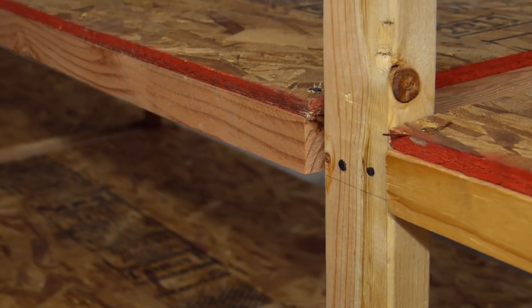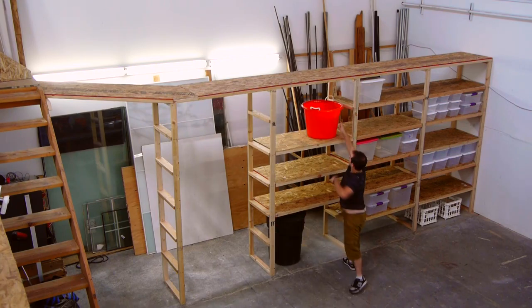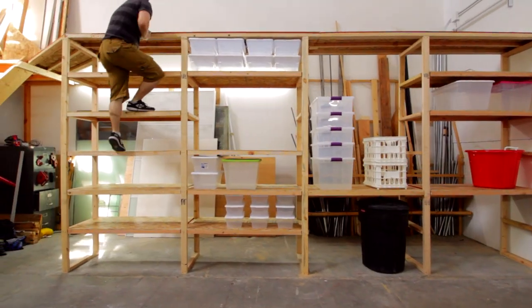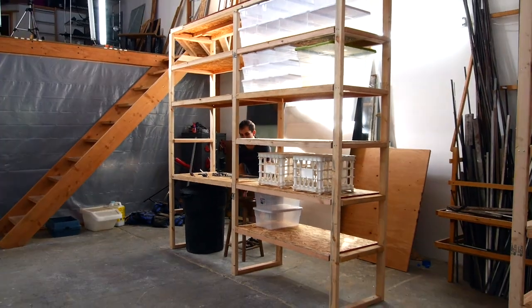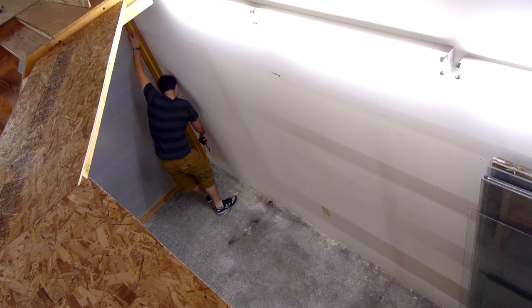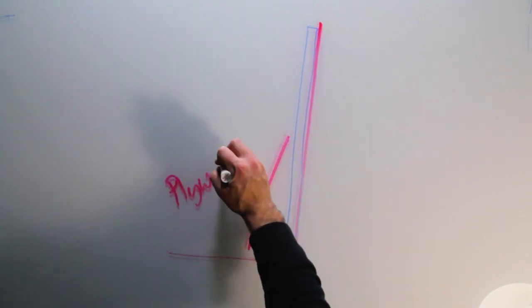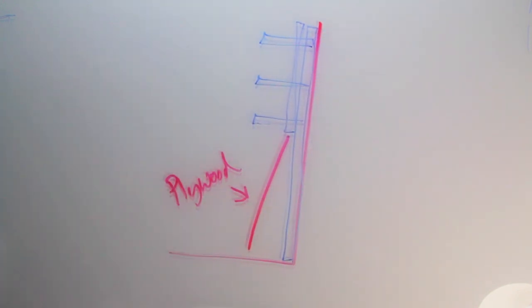I ended up putting together only 13 shelves of the 20 possible mounting locations, which was more than enough to create a configuration that would work for me. I eventually settled on a configuration that gave me a little extra workbench in the back as well as an extra walkway for easy access. Before putting the final touches on the shelving unit, I decided to put together a simple lumber rack to go behind it against the back wall. This would include supports made from 2x3 beams secured to the wall — the bottom 4 feet left clear for storing plywood, and the top section reinforced and bored out to fit 1-inch EMT tubing segments to hang longer sections of lumber.